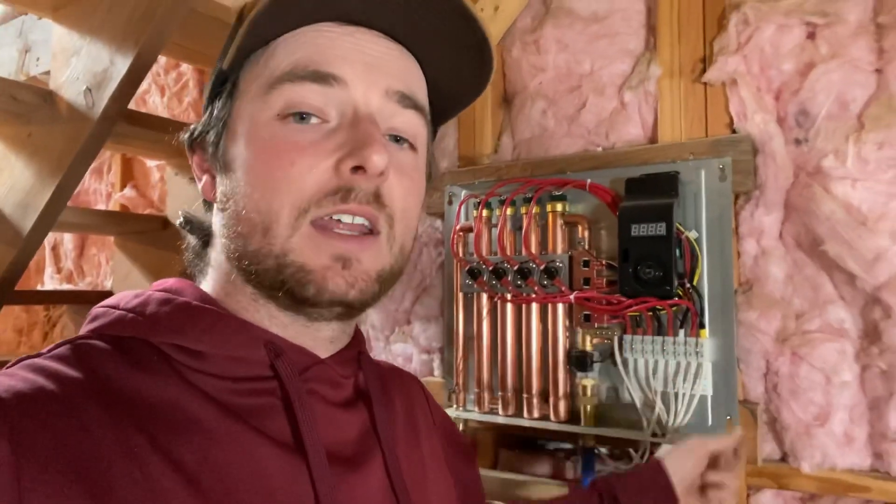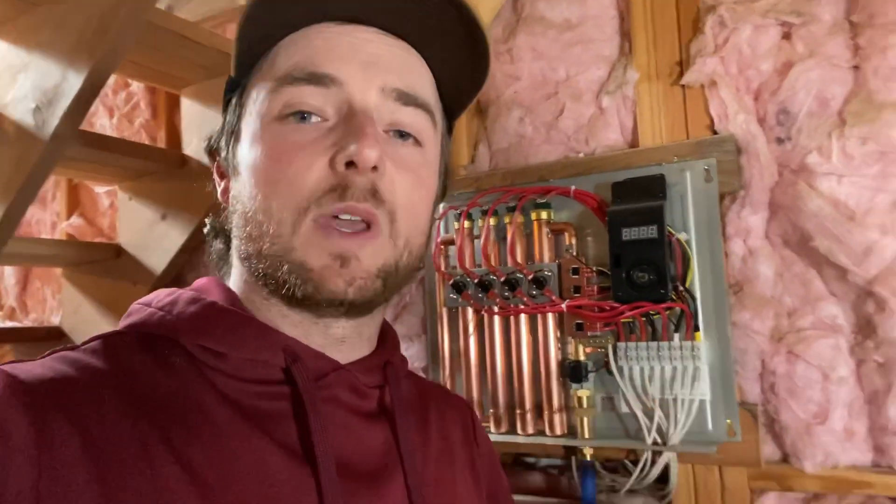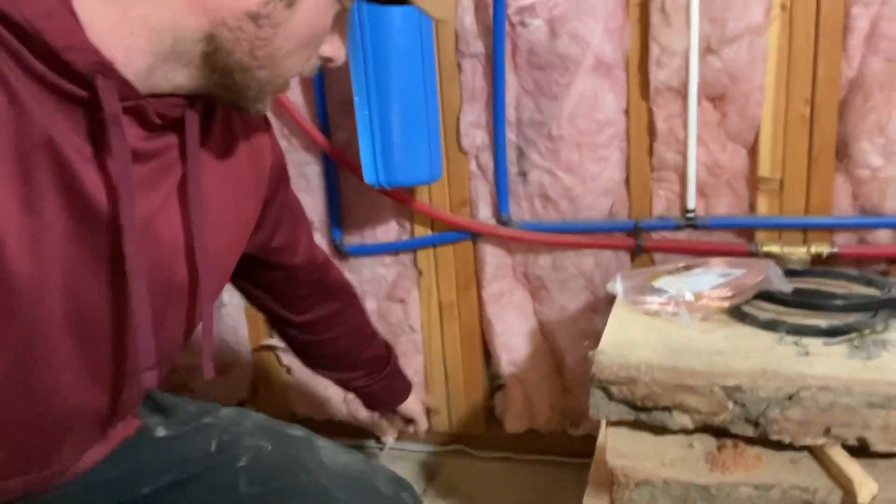What I'm going to do is add a grounding rod specifically for the water heater — doing two things: one, grounding the water heater right here, and two, it gives me another grounding point and makes everything a bit safer. We're going to come out of this grounding point with two 4-gauge wires and that's going to go right outside and connect to an 8-foot grounding rod that we're going to pound out there. I already have a hole drilled — a half-inch hole through the metal — and we're going to hope two 4-gauge wires fit through it. Let's head out there and see where that hole came out, dig a little bit with the post hole diggers, pound that rod in, and clamp it all up.